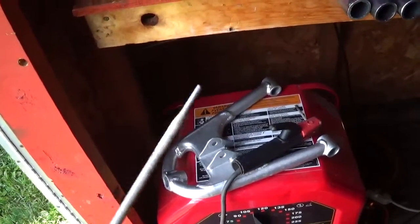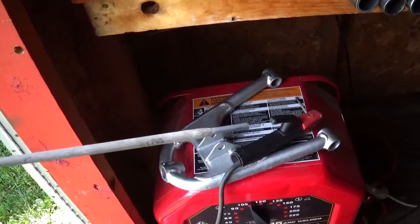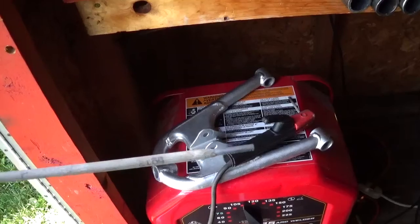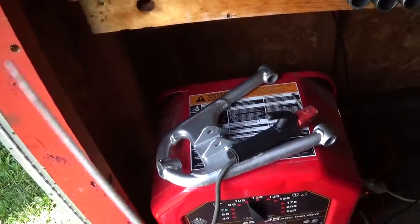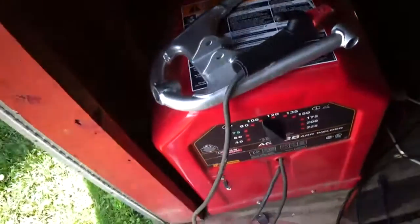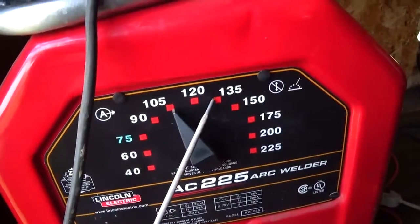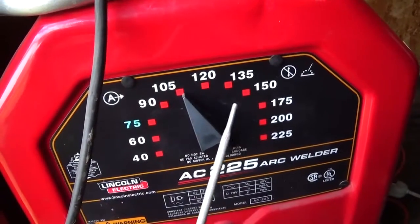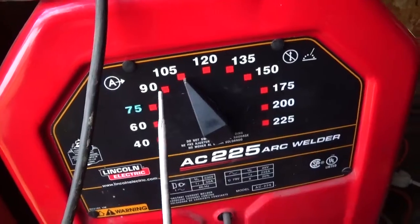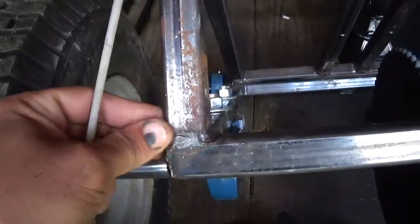Basically, it's a welder set up in a shipping department that they weld like plugs on the end of the tubes. Nothing has to be pretty, it just needs welded on there. But that's what these guys use. And that 480 welder runs around about 135 amps to use these 1/8 inch rods, and it does a nice job. Matter of fact, here is a weld that I did with it.